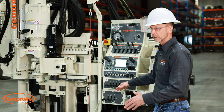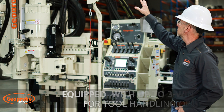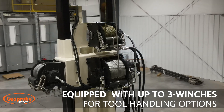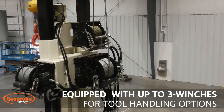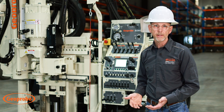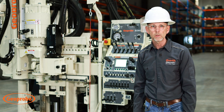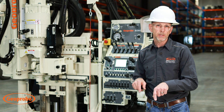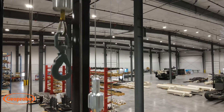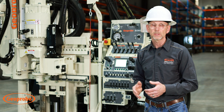This unit is equipped with three winches: our main winch at 6,800-pound pull, our secondary winch at 2,500-pound pull, and our wire line at 1,100-pound pull with 250 feet of line. An option would be an 1,800-pound pull instead of the 2,500. The 1,800 and 1,100-pound pull winches come with a quick release where you can quickly take the safety hook off and insert an overshot for rock coring in literally just seconds.